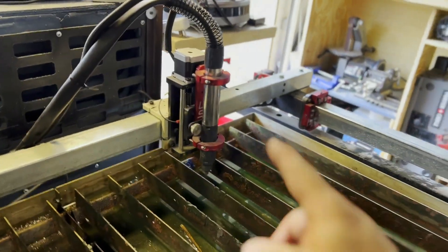You might be thinking you don't have 220 in your garage. But if you want something like a plasma cutter, 220 may be the investment you want to make. If you want to weld bikes, cars, or anything else like that, you need that weld to penetrate the metal. You need to melt the metal, clean it, and add the filler rod — which uses similar metal to bond it together.